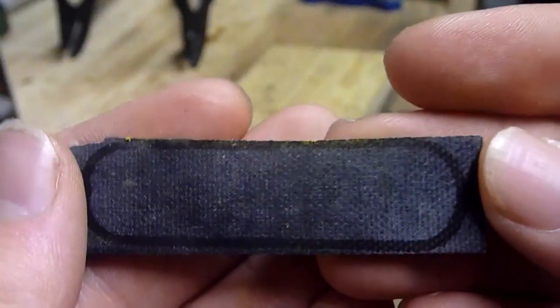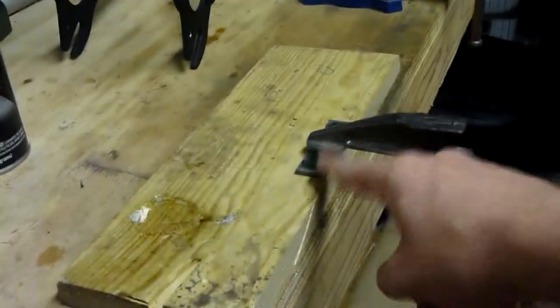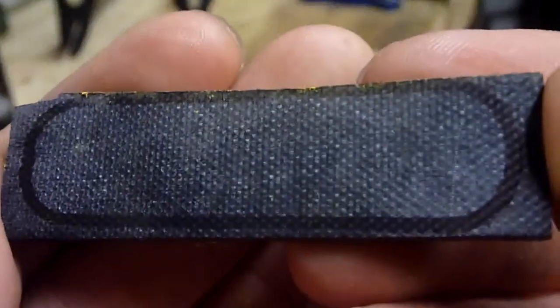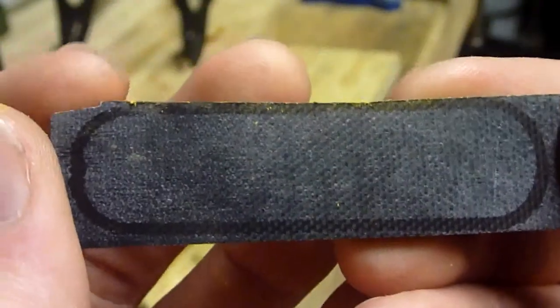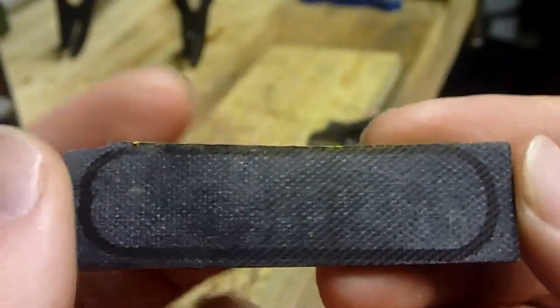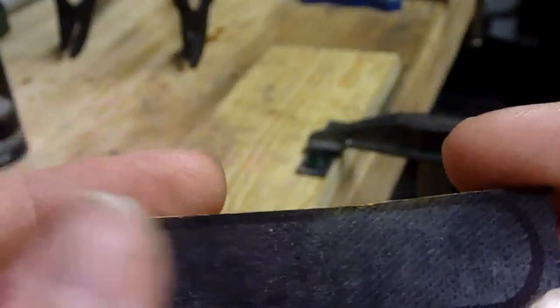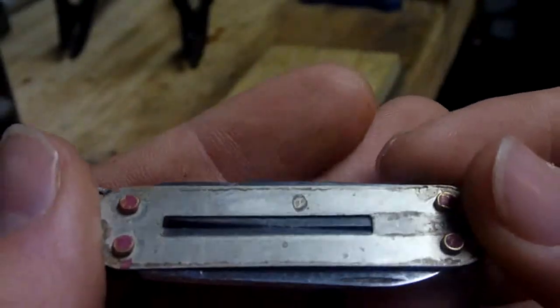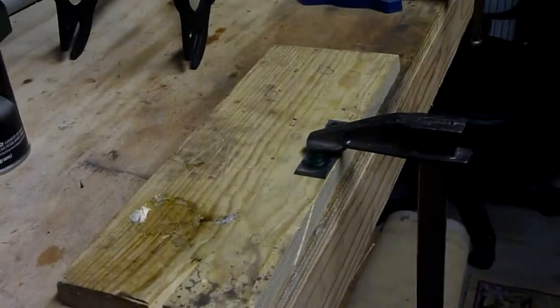The scales have been trimmed down — obviously this is only one, the other one is right here ready for drilling. As you can see, the scale has been trimmed down to a more workable size and now there's only just one on the piece of G10. The other side is the textured side and this is the side with the little drawn-on areas. Right now I'm going to be drilling the clearing holes for the standoffs, and then we're going to test fit them.